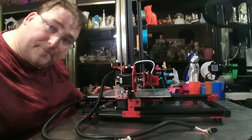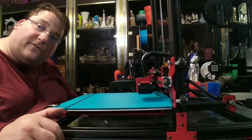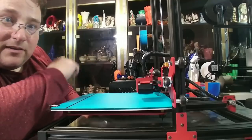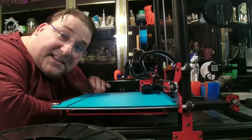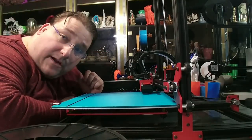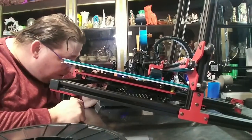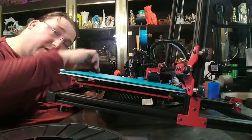Glass is installed. All the wiring is now connected. Control box is connected, and we are ready for first power-up, bed leveling, and to see what happens. I do have a bad coupler, but it appears to be stiff enough that I could probably get away with the first print, and then I've got to go find a coupler to replace that. It's booted up. The axes work, and this thing actually has assist bed leveling where you touch the corner on the screen, it goes to each corner, and it stays on the screen until you're done. You can also hit unlock to unlock the steppers. My normal way of leveling — I lift up the bed, look at the gap at the nozzle, and adjust it until I like the gap, then go to the next corner. Go around twice, because when you adjust one, you affect the others.